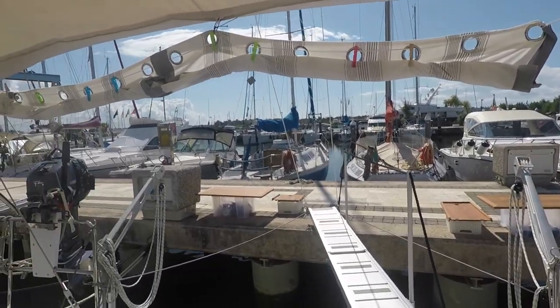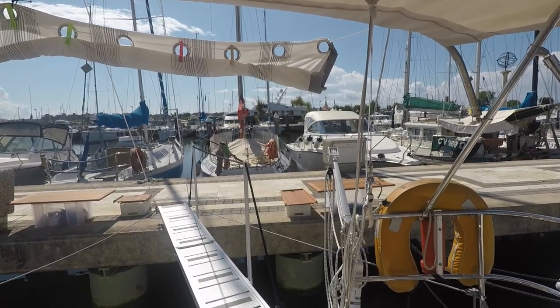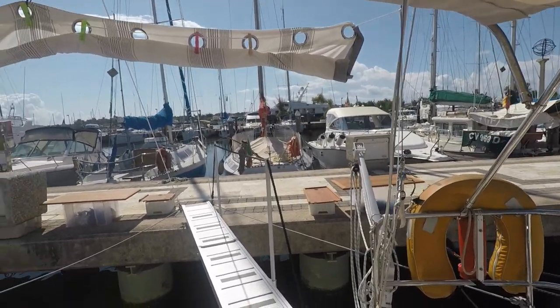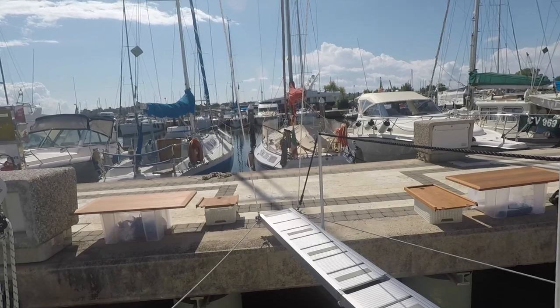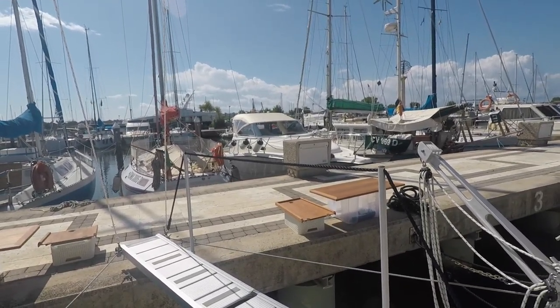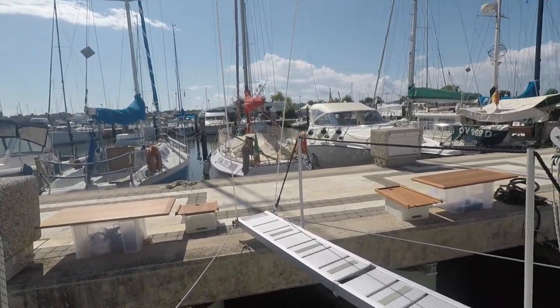On the tabletops there are some markings — some wine spills, places where tools were placed, maybe a little nick here and there. Not bad at all. I actually kind of like the look; it gives a little bit of a distressed look. It makes it seem not like you're creating a piano top or a fine piece of furniture. When you put that first coat of varnish on it's like wow, that's really beautiful. But like any painting project, prep is huge — the sanding, the cleaning, wiping it down afterwards — that's going to pay back in huge dividends.